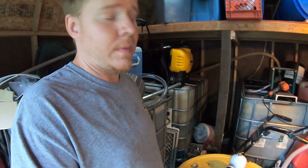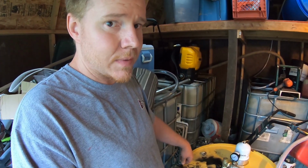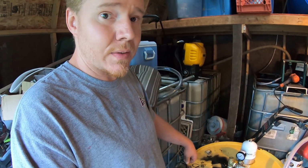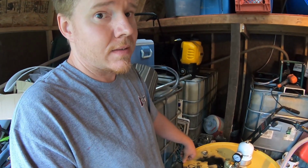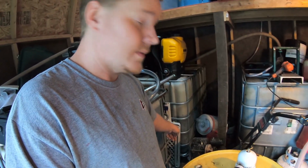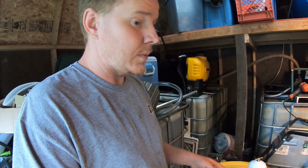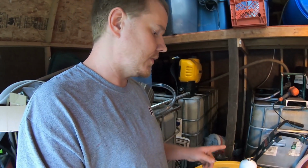So you also have to keep in mind that was 1.35 ounces of submicronic material, mixed with moisture that had turned into a liquid sludge. That's stuff your filters aren't going to catch to begin with. So the vast majority of what your average filtration systems are going to catch is all sitting in the bottom of that tote. So this oil would have passed through those filters without an issue, and they likely wouldn't have caught much of anything. This setup was able to pull an extra 1.4 ounces of material out of the oil,